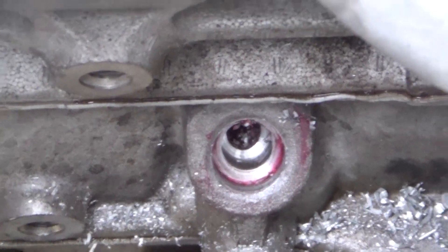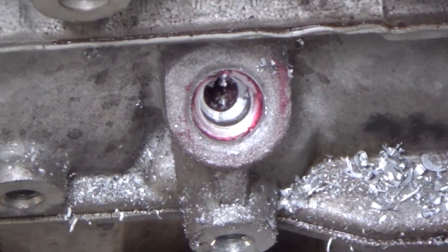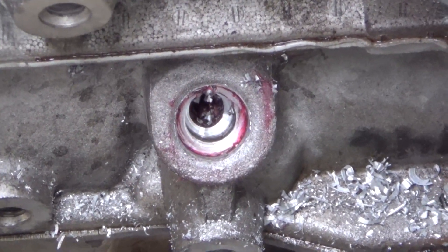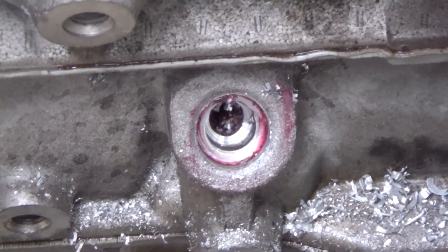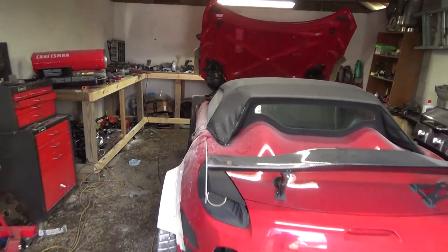Here's the hole we have cut so far. What we need to do is get a bolt and stick it in there to kind of fill that hole so whenever we do tap it and create the threads, none of the shavings go down into the oil. Delmer's in here cutting the top off a screw to make some room.